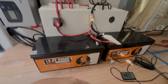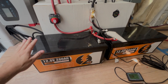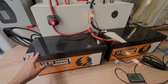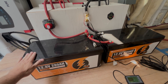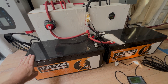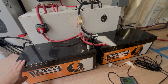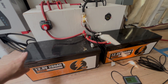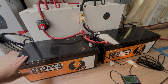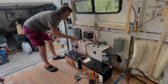That was the overview of the batteries — two-battery system, about $1,000 for both on sale. These are lithium iron phosphate (LiFePO4) batteries, which are fantastic. They have monitoring systems built in, so you avoid voltage drop issues you'd typically see with lead-acid batteries. These were super important to our build.